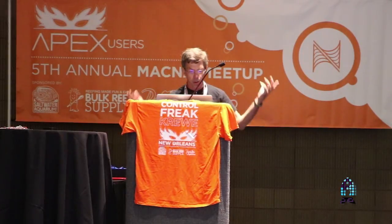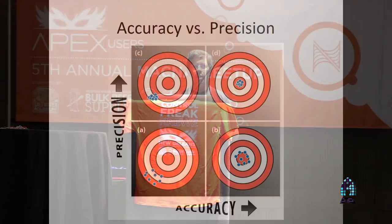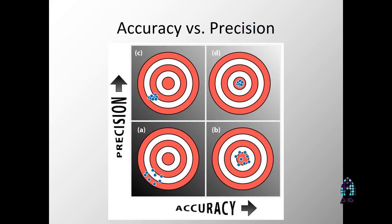It's really simple. When you're measuring substances into solutions, when you're testing for things, there really is a correct number. There is a true value. There are exactly so many calcium ions in that water. So accuracy is getting the right number. It's hitting the bullseye. Precision, on the other hand, is being able to hit that number over and over again when you're doing repeated tests. It's the repeatability of what you're doing. So you can think of it as accuracy is hitting the bullseye, and precision is a nice, tight grouping. That's the difference between accuracy and precision.